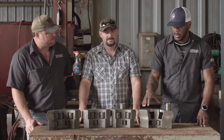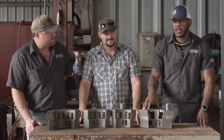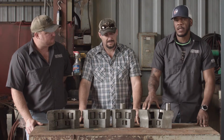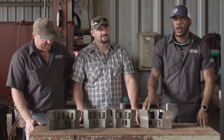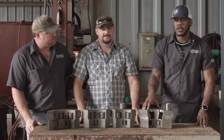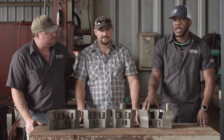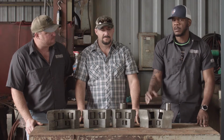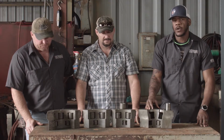Here at Spoke, we have already conceptualized and designed a compensating stand elevator where you could run doubles, triples, or quads, compensate really as much as you desire. Practically, you do 2-3 inches worth of compensation, but because it's an independent system, our rams probably can compensate up to 6 to 10 inches if required.